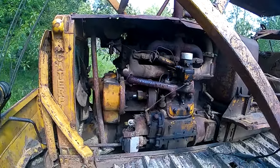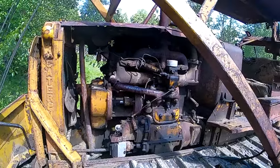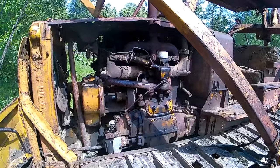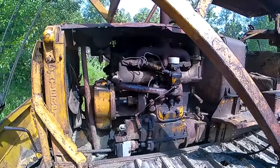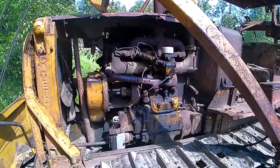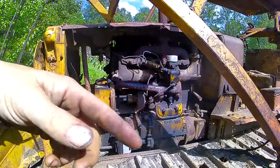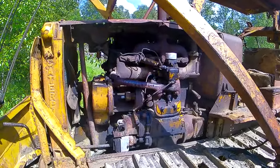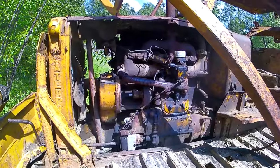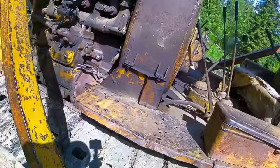Now, you hear stories from the old-timers that used to run these things, and they hated running them in the winter because the newer machines with the electric starts and whatever else wouldn't start at minus 40, so they'd get a day off. Whereas with these, as long as that putt motor starts, you can get them to start. You let it sit and turn over and turn over for a good 20 minutes if you have to, until the diesel's warm, and it will start, always. It was actually an ingenious system.